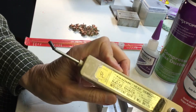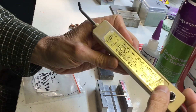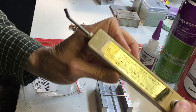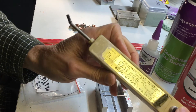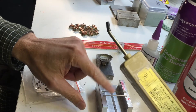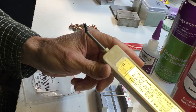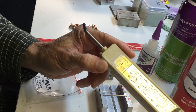You'll need one of these — a demagnetizer. This is a tape head demagnetizer, a Realistic from around 1970, got it off eBay for about 20 bucks. Try to find something that can demagnetize, because this is important — if you don't demagnetize the parts, the armature and the balancer, it's going to make it harder to get a reading. This is a big deal.